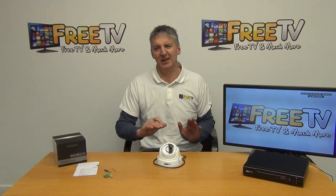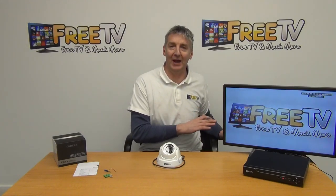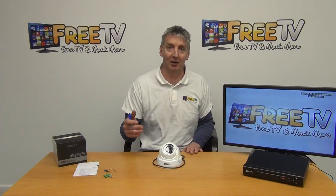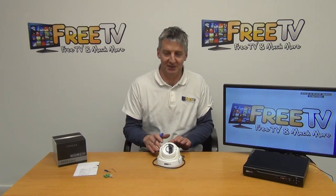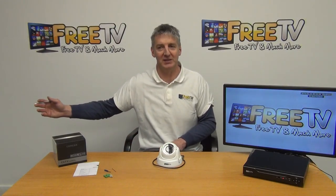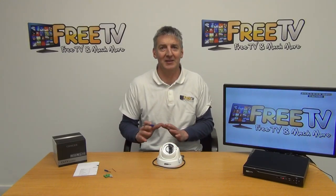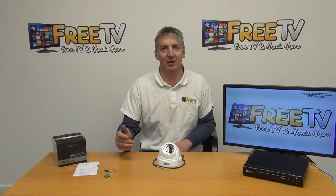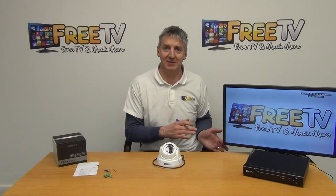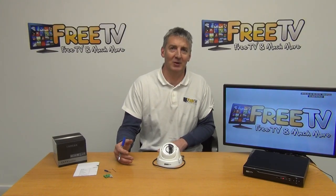For some time now we've been trying to say to our customer base that really what we should be doing is migrating away from the old analog and the 960H — which was sort of semi-HD analog — over to the full HD that's capable here. The big advantage of going this route rather than jumping over to IP is we can use exactly the same cables, the same power units, and the same basic connections. All of a sudden we have the same skill set, the same cabling, but we're into the one megapixel resolution tier.